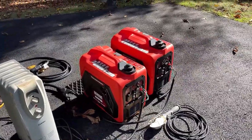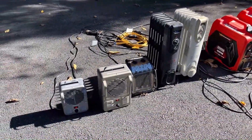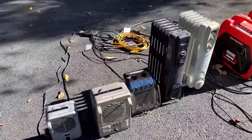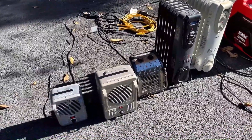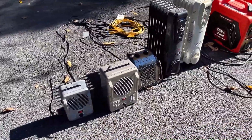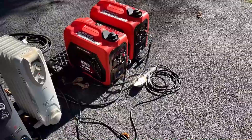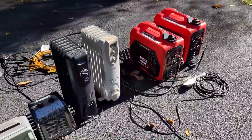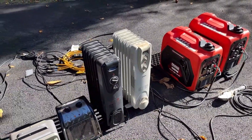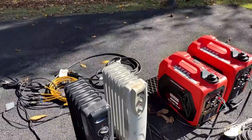The engines are definitely working pretty hard at 6,000 watts — I can feel the heat of these four space heaters from here. Now each of these technically isn't exactly 1,500 watts; on high, they're actually a little bit more. So with all four on, I'm estimating it's closer to 6,200 watts, plus another 100 watts for the light, bringing us to 6,300 watts. If I turn this last space heater on low, that's another 600 watts, putting us right to the point of overload — and we might actually cause a shutdown. But let's try it.